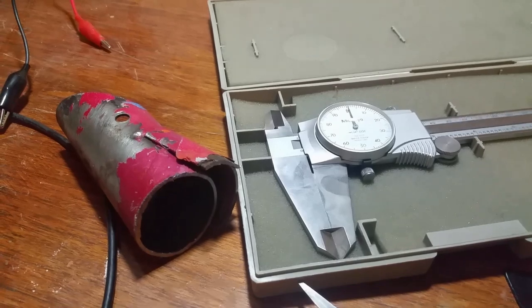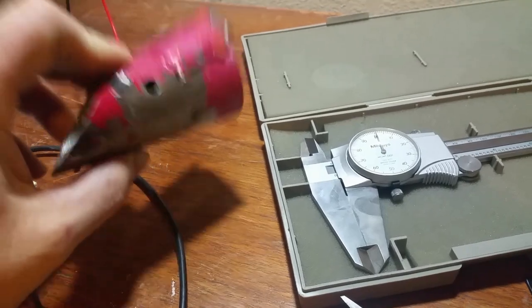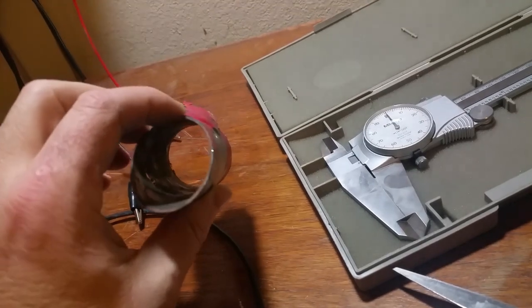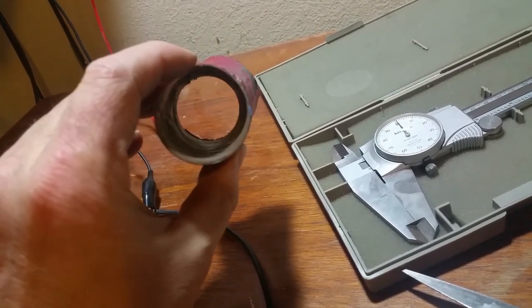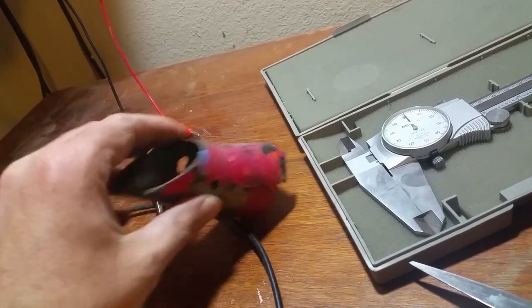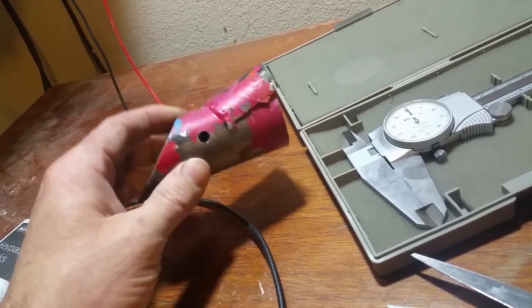Jeez. All right, this is the thing that always ends up taking a lot longer than you expect. So I got off the old one, and the last time it took me a while to cut off the old one and get it prepped. Now I have to order the replacement tube. This is 1.5 inch ID and .058 wall. It is seamless, so DOM, drawn over mandrel. That way it doesn't have the weld bead like on the really cheap tube that you buy. I don't know exactly what steel this is, but I have full confidence that 4130 is more than sufficient.